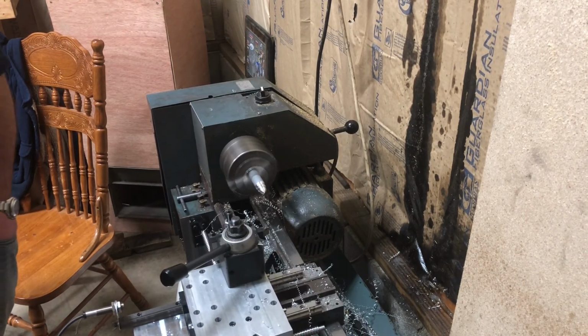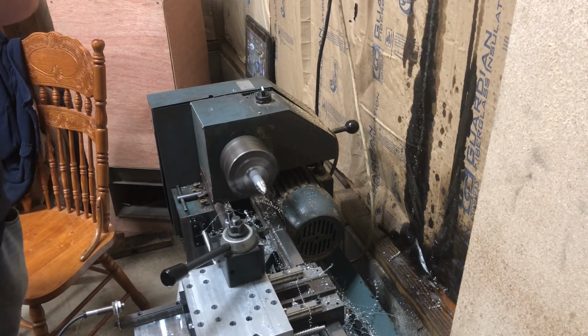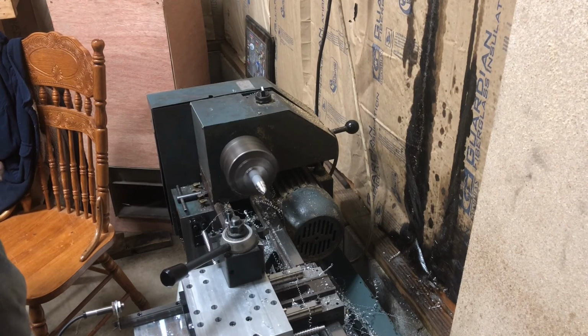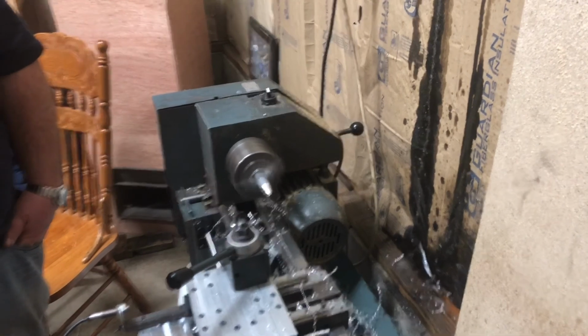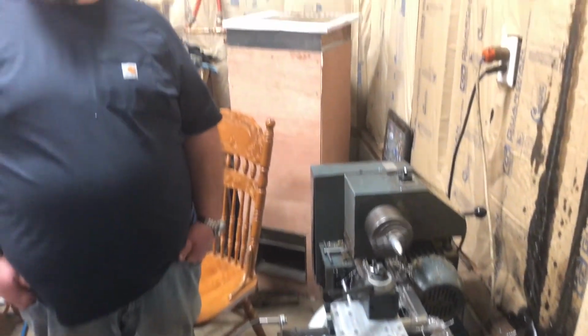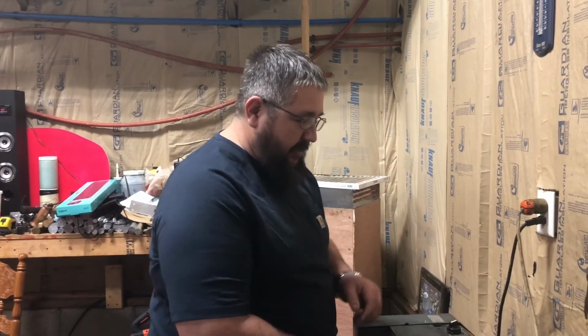Took a minute and 24 seconds to run. If you guys have seen any of our other videos on the mill running this instead of the lathe, this size finial would have taken us at least probably 7 to 8 minutes, and here we are, we're done in a minute 24. The more rapid returns for the Z, the faster, and actually it's more rigid than our setup was on the mill, but I'll take the part out here real quick and show you